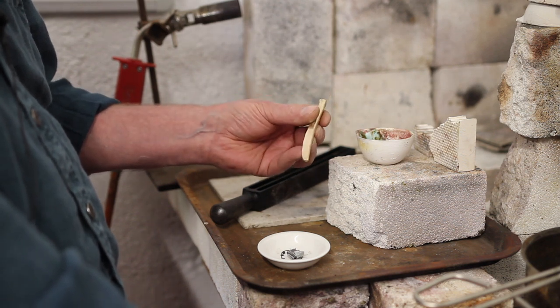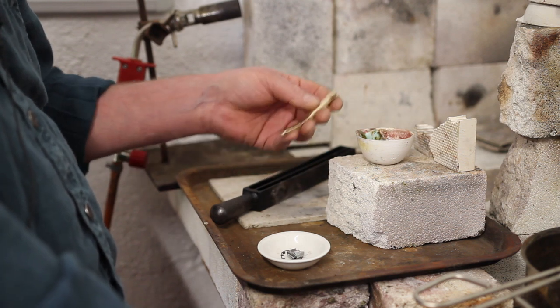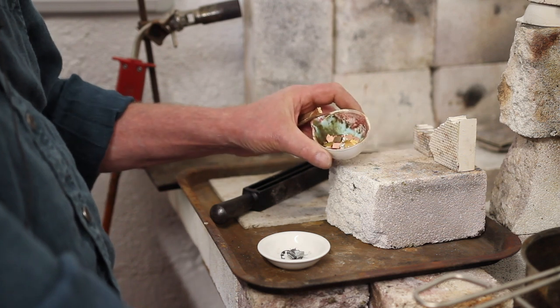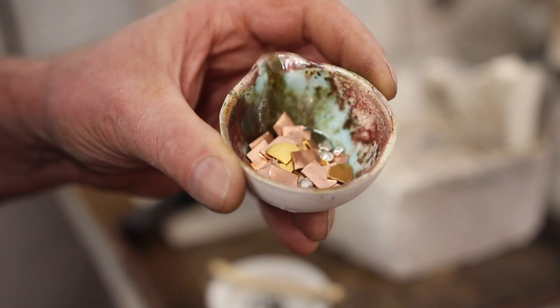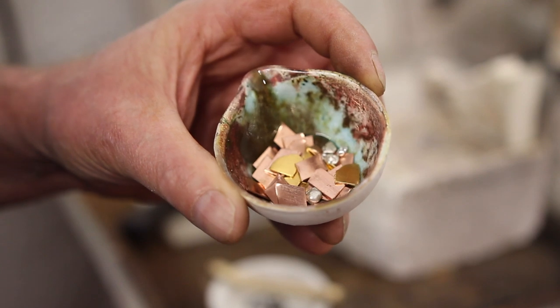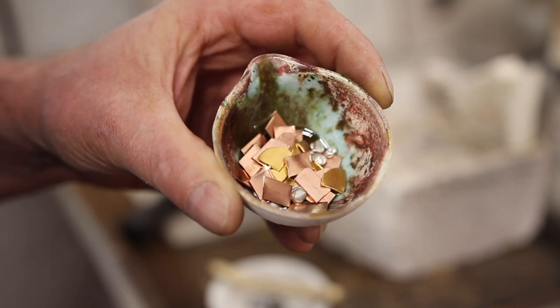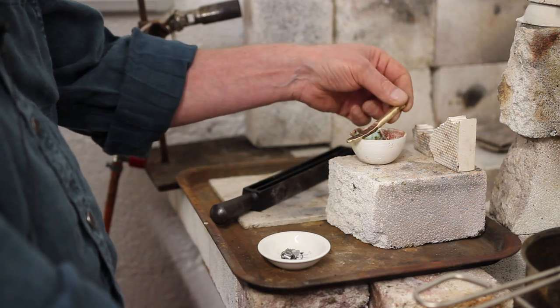We like this colour — it worked really beautifully when we remelted the bit that broke off, so we're making some more. In the crucible here we have copper, gold, and fine silver — that's pure gold, pure silver, and pure electrical copper in the correct proportions to give us the same alloy less the zinc. So I'm now going to proceed.